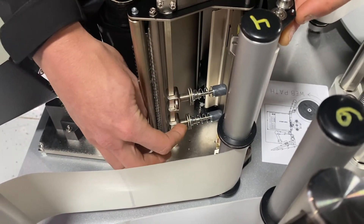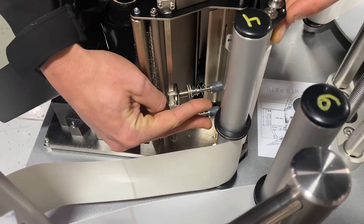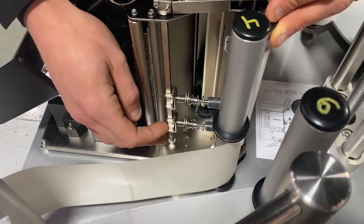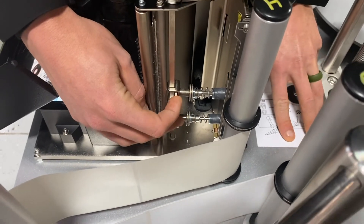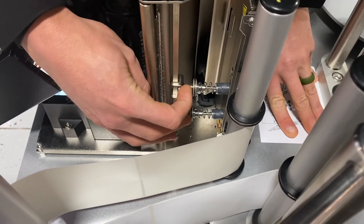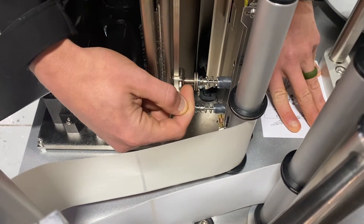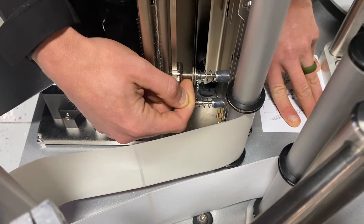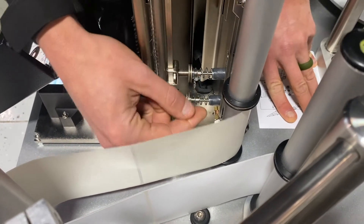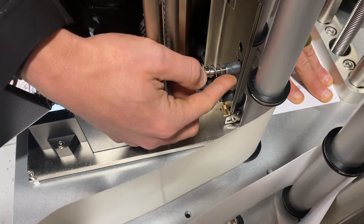You can also apply tension and pressure downwards on the printhead. When doing this, you would do this to try to increase print quality, but you must be very careful we don't apply too much pressure. The distance from this to the bottom plate here should be no more than 12 millimeters. If you're getting past that, there's a good chance you're going to ruin that printhead much faster than it should be.